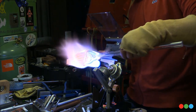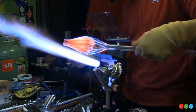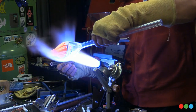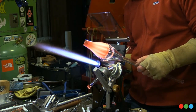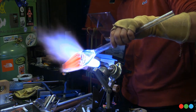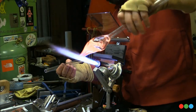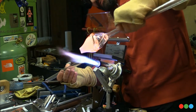I don't like to handle up until I really need to, so I'm actually just soaking that heat in. My handle's ready, but there's no need to put it on until I feel like it's about to get loose. It's just easier to control that bundle at this point. It also lets me keep my hands away. Once there's two handles on, you're stuck right in front of it, like a kid getting cancer from the TV or whatever.